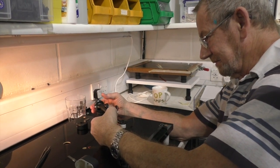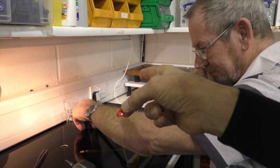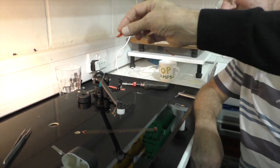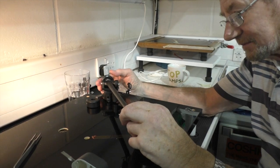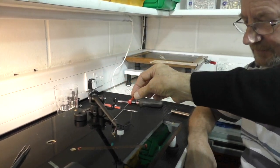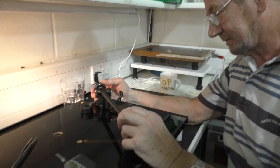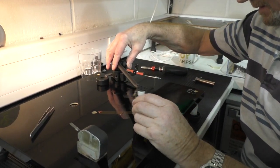And horizontal — I'll show you. You just bang it on the side. We have a magnetic bias and there's a residual, so we have to just cancel that. But if you just take that and move it through 45 degrees — just a slight bit moving. Can you see it moving slightly? Just starts to move. It won't move much because of the bias holding it in place. There's also oil in the bearing — it's a major part of it.